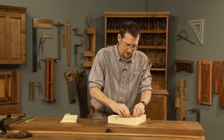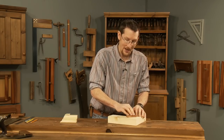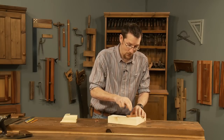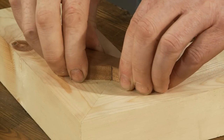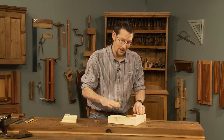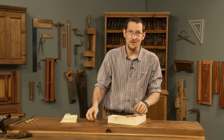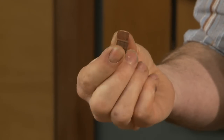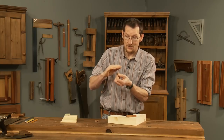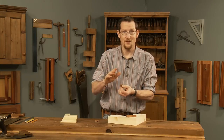There's no need to beat this thing into oblivion. Just a gentle tap and some glue, and that is strong enough. Don't expect it to go all the way flush with the surface, because what I do in practice is just get a saw and cut it off and then plane it flush. I've made these deliberately deeper than what I actually need, for the purposes of just cutting the top off when I'm done, as it gives a very neat finish.